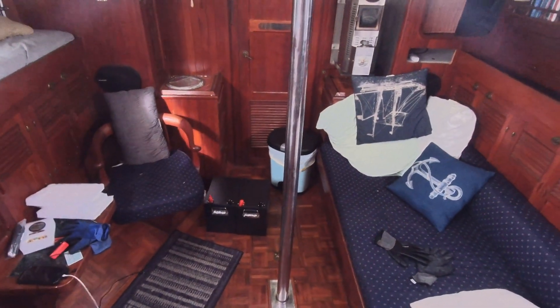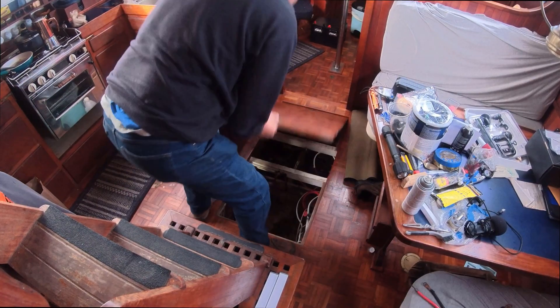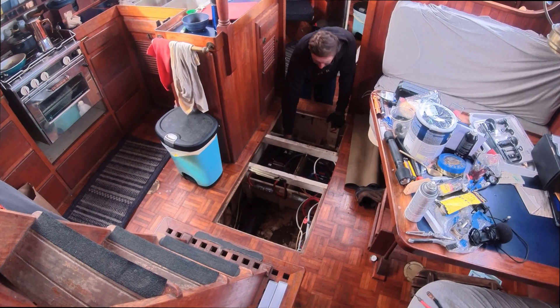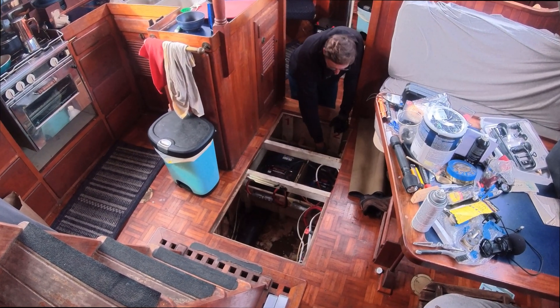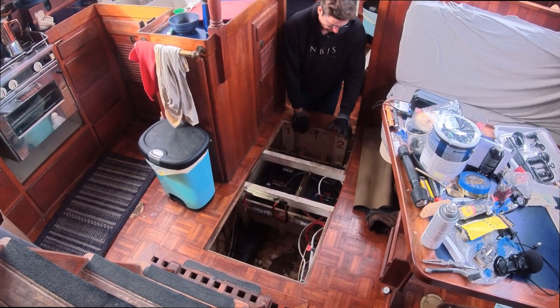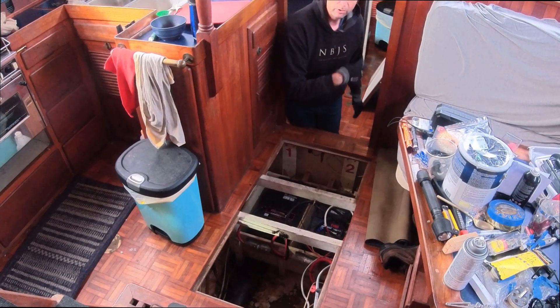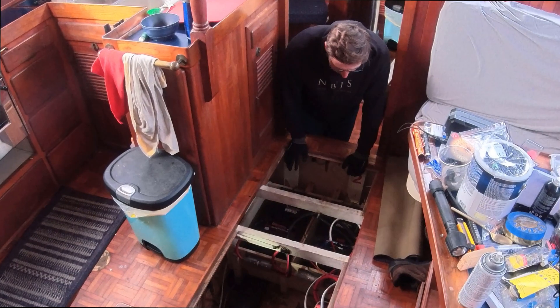Today's the day I'm working on my battery installation. I've already put in some extra solar panels at the back of the boat and hooked up another charge controller. I'll be replacing the old charge controller with another one for the remainder of the install. For today I'm going to be installing those two lithium iron — LiFePO4 — batteries, but first I've got to get the old one out from down under the floor. I have two 8D batteries down here: one is the starting battery which I'm keeping, and the other is the deep cycle battery I'm replacing with the two lithiums. They'll fit in a little less space so I've got to work out how that's going to work, and put them in parallel to maintain 12 volts.